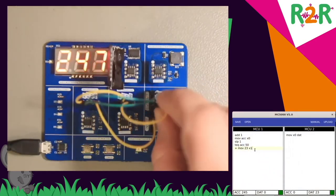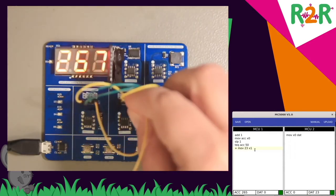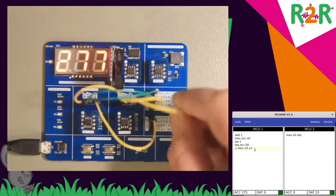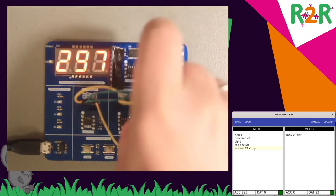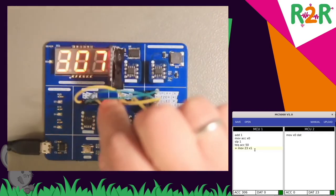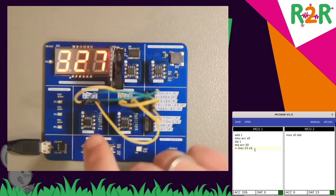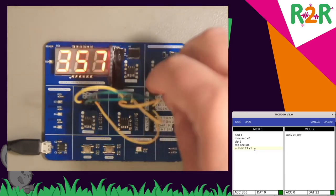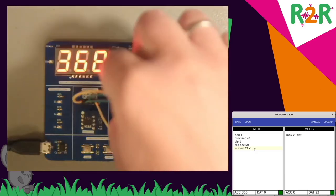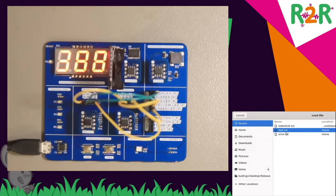So to solve this problem, I'm adding a couple of connections. So use the yellow LED. The green one with P0, because both controllers only have two simple I/O pins, and I can only use simple I/O with simple I/O pins. So I'm using the second controller as kind of a port expander. So the remaining connections can stay as they are.